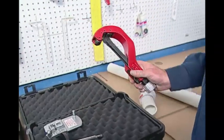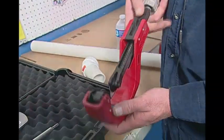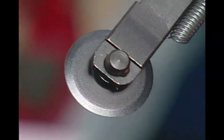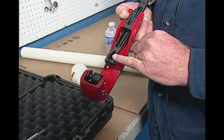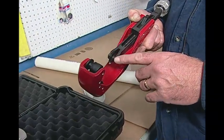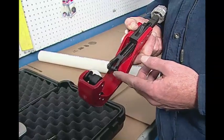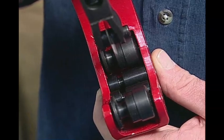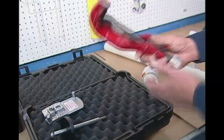It comes with three pieces in it. It's got the quick-release cutter with a special plastics wheel in it. This wheel has a very thin profile and will allow you to cut through the pipe very quickly. It doesn't get fatter as you go in towards the hub, so it will allow you to cut through the pipe without raising too much of a lip on it and do it very quickly. It's a tool steel, so a better quality steel than you would find in the vast majority of cutters on the market. We've got multiple rollers up here so you're not oblonging the pipe when you're aggressively cutting through it, and it's a quick-release so you can get it on and off very quickly.